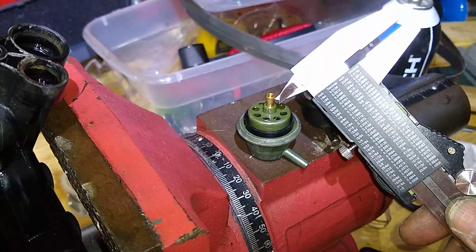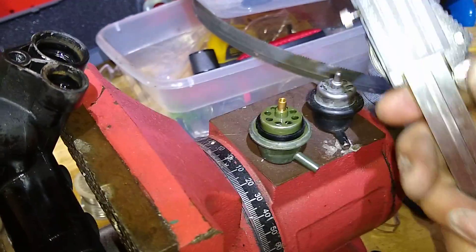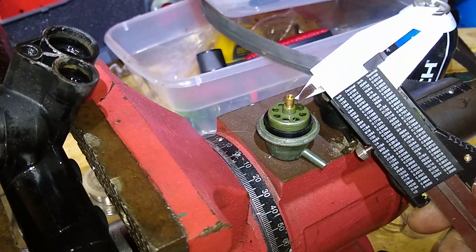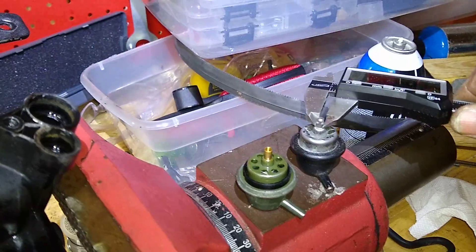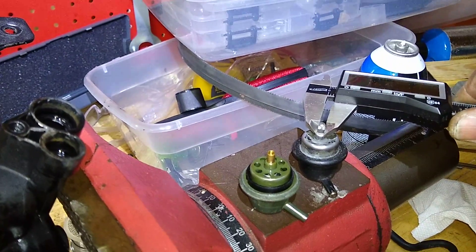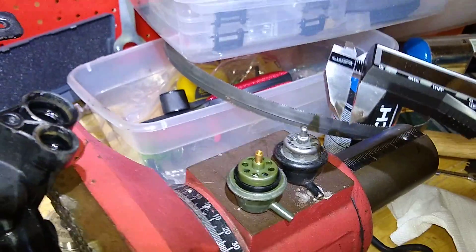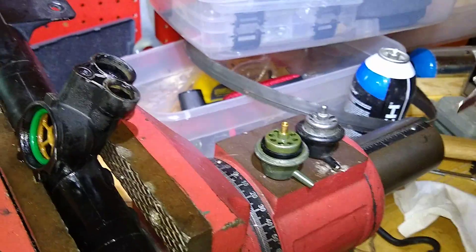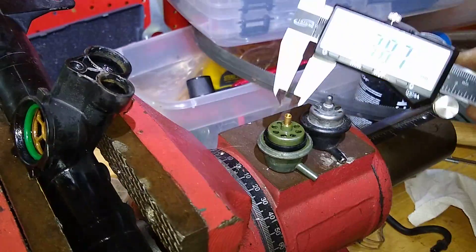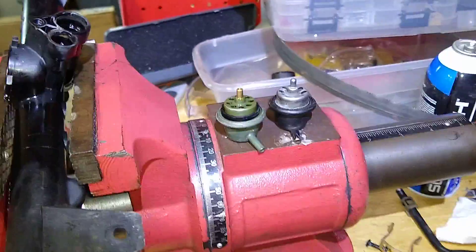Fortunately, the pressure is on the outside of this, and it's creating compressive stresses on the brass instead of expanding forces if the pressure was inside that inner diameter. Now the difference is, on the OD this is 3.87, so it's a little bit thinner. You could technically bore the stock one out and be okay. This comes from China with something like a 1/16th of an inch hole — it's incredibly small — so you pretty much have to bore it out no matter what.